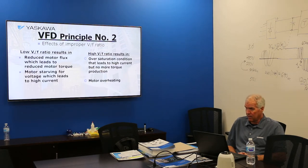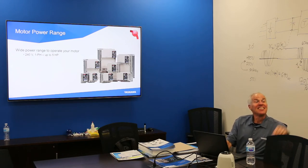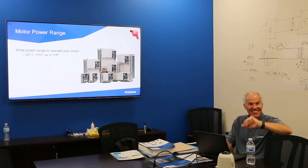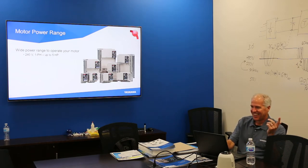Drive protection itself is vital. In my judgment, with an incoming voltage power supply issue, a drive should protect itself — and you shouldn't have had to beat all those drives. Do they have DC CTs? Do they scan those DC CTs accurately and rapidly within the guts of the drive? Not all drives are built correctly, and this is what you're running into. I've been in this business 30-plus years and we're the best in this area.